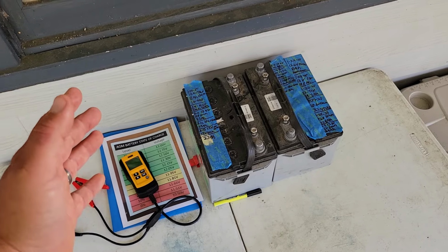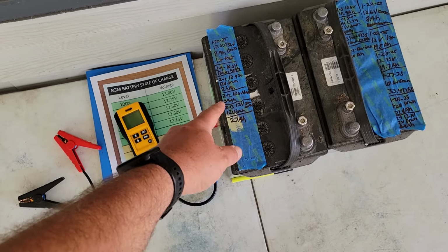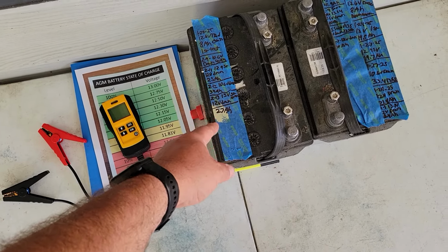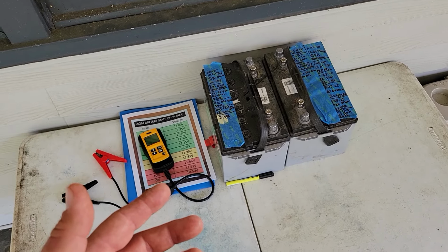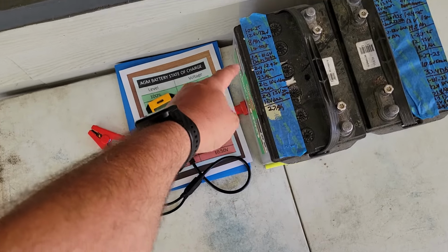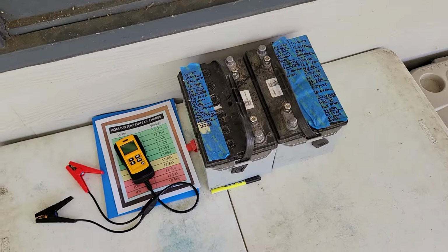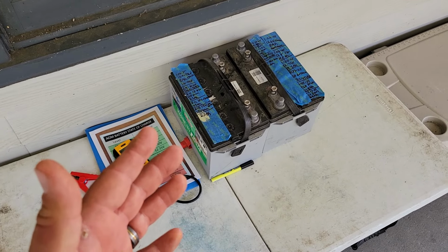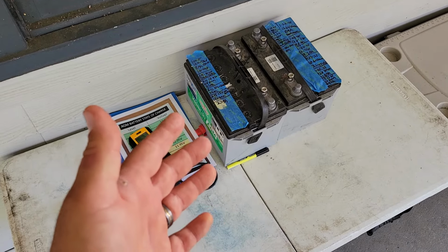You've wiped out as much sulfation as you can, because as you can see from doing the second procedure, I didn't really gain that much. I gained 2 amp hours. I don't really think that's worth doing a whole other procedure for 2 more amp hours. But that is worth doing a procedure from going from 8 amp hours to 25. That's a pretty significant increase. And that's about the best I'm going to get out of these batteries, because they were severely abused.